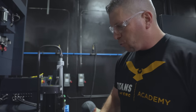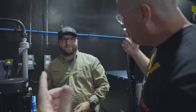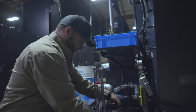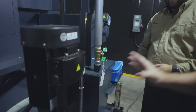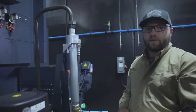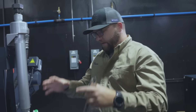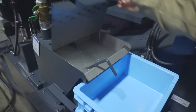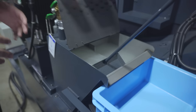The coolant tank is on steroids. Jason — our great service tech from Makino, who's been here every single day — is here. This is actually a filter for the coolant. We've got a cyclonic filter that brings you down to 25 microns, keeps the coolant balanced and all the scum out. There's a separate disposal tank that thoroughly cleans it, so when you're running through-spindle coolant, all the debris is gone.